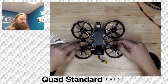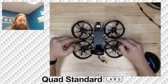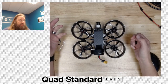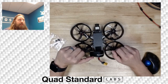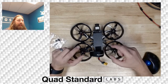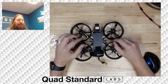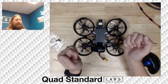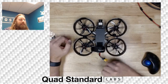Lastly, if you do notice there's a big gap, a difference between the gap here and here, left to right between your ducts, especially if you built it yourself, it could be that the arms are also mispositioned. So one of the other things you may need to do is loosen your arms and get them centered inside those screw holes, or at least get them symmetrical to where everything lines up. But basically bringing these arms closer or further apart to make those two gaps symmetrical.